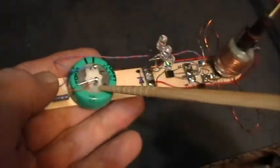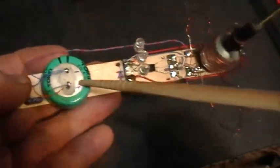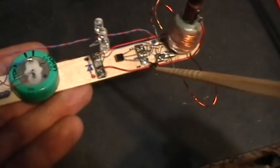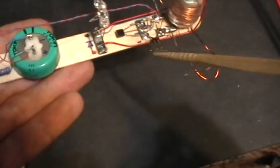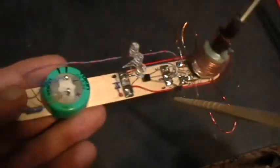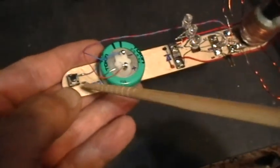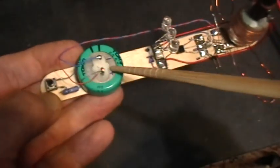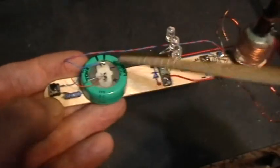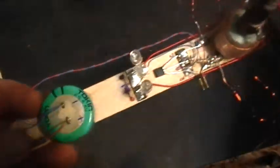And here's a capacitor. Instead of the capacitor he used, I'm using a 1 farad capacitor there, and it's hooked up across these two little pins where the LaserSaber capacitor is normally hooked up, and this is where I will be feeding power into the circuit when I charge the capacitor. And then this over here, this is just a push button switch and a bleeder resistor hooked across the capacitor, so that by pressing that I can discharge this capacitor in a controlled manner down to some desired voltage, or all the way if I want to. And I've been pressing it, so you can see that the LEDs are out now.